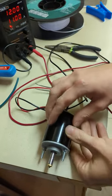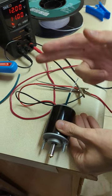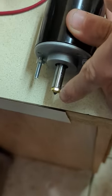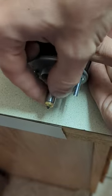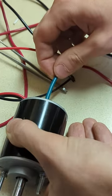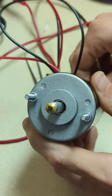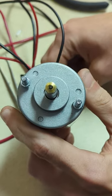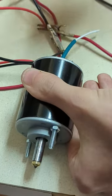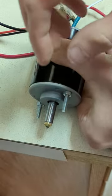This is a 24-volt DC motor that runs up to 7,000 RPM or more. There's a diamond-back polycrystalline diamond FDM nozzle screwed into the hollow shaft, and there's a piece of white PLA stuck into a Bowden tube all the way down the hollow shaft until it butts up right against the inside of the diamond nozzle — the filament is basically touching the backside of the diamond. What I'm going to try to do is extrude this filament without applying any heat to the nozzle, just by the rotational frictional heat of the filament pushing up against the nozzle.